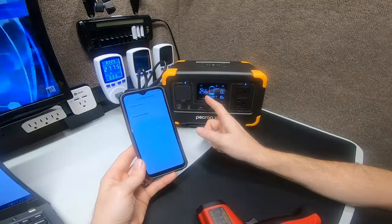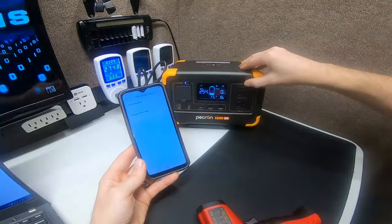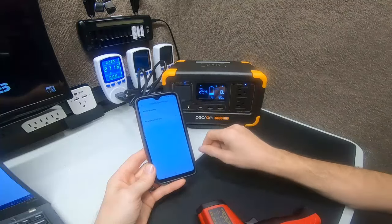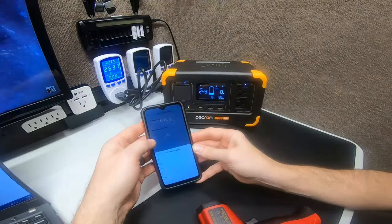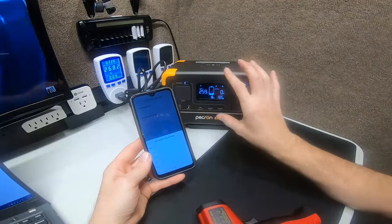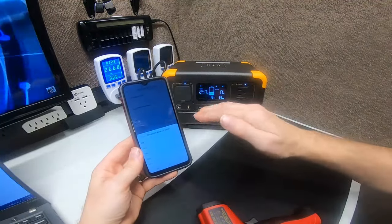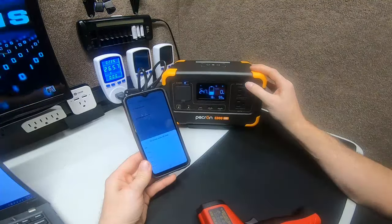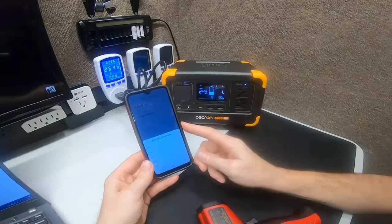Output shows 118–120V at 60Hz. The app also has a 'no output auto-off' timer — one, two, three, or four hours. I'd prefer Bluetti's approach where you can set a wattage threshold, like shutting off under 5 watts. Bluetti also has separate DC and AC auto-off options. This app needs a lot of updating, but I can't hate on it — it's their first app.